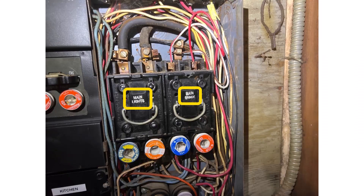So we might expect to find 60 amp fuses on one side and 40 amp fuses on the other — which gets us to our 100 amps. It's nice to know how these work, though they're not all wired this way. The big indicator at this particular house was the fact that both pullouts were labeled 'main.'